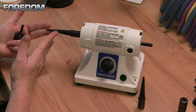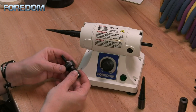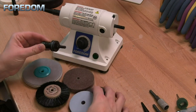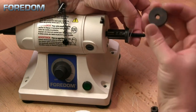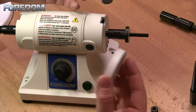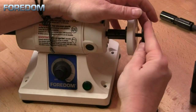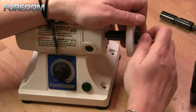On my machine I typically leave the left side as the tapered spindle. However, there are accessories such as the wheel mandrel that can be used on either the right or left side — but it does matter which version you use where. The wheel mandrel holds any item with a quarter inch hole. To install, remove the washer and the small plastic washer inside, slip the wheel onto the bench lathe, put the plastic part back on along with the end cap, and tighten with the nut until it's nice and secure.